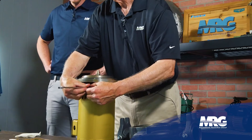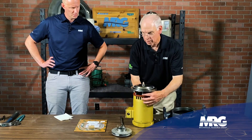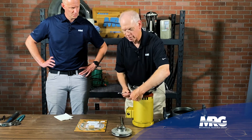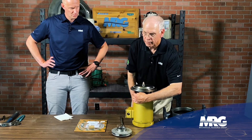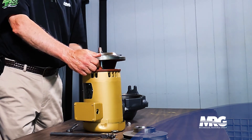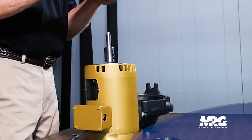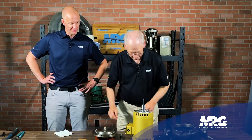The biggest problem you have is dirty water. On heating systems with steel pipe, if you don't have good water treatment, you could have rusting in your system. If you do repairs or expansion and shut the water off, when you turn it back on the pressure will loosen materials in the pipe system. If multiple pumps start leaking at the same time, you might have a water quality or system issue to check out.